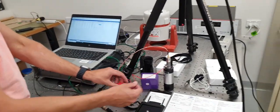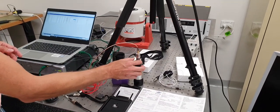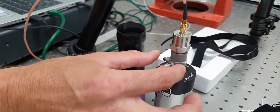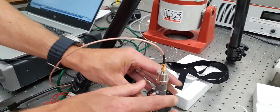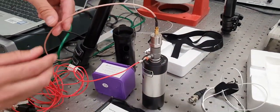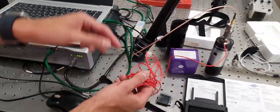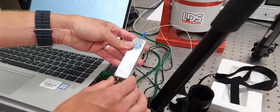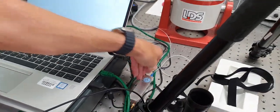What we've set up here, to give some more detail, is an industry standard, commercially off-the-shelf, integrated electronic piezoelectric transducer, stud mounted directly onto the calibrator. The device on top is similarly a piezoelectric transducer, but in this case the signal conditioning, rather than being provided by integrated electronics piezoelectric, is provided by a fiber optic based solution, a bespoke solution by one of our industry partners at Vibration Lab in UTS Tech Lab.